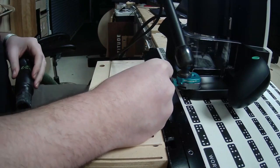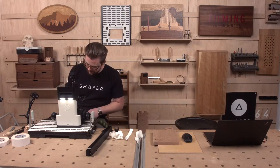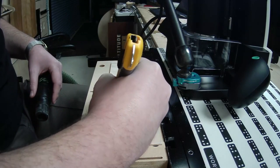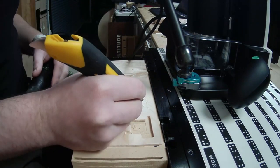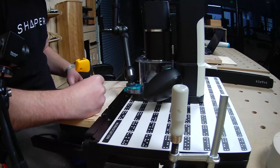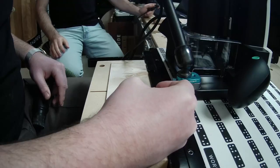Cleaning out any dust in there. The downside of using a straight flute small bit is you're going to get compacted dust — that might not have been helping during the finish pass. Could use tweezers or a dental pick to clean that out. With a little offset still in there, it's definitely impacted. On something like this, if you're confident in your Origin skills, you could go straight to zero as long as you're steady — the cutting forces are so light for inlay and marquetry that you really can just go right down to the line.